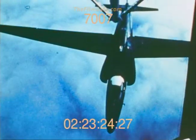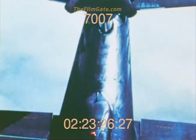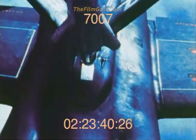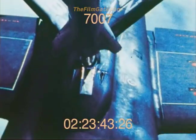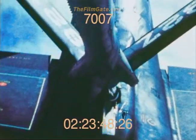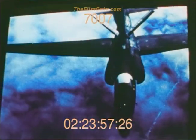The silver area in the center of the upper fuselage is the receptacle. Notice that the flaps have been raised into what has been referred to as the gust position. This unloads the wing at high indicated air speeds to compensate for gust loads and at excessive Mach numbers to compensate for the change in aerodynamic center of pressure and unload the tail. This unique feature was utilized in 1955 in the U-2 and has been utilized extensively in the development of larger transport aircraft to unload the wing during gust conditions and severe turbulence.